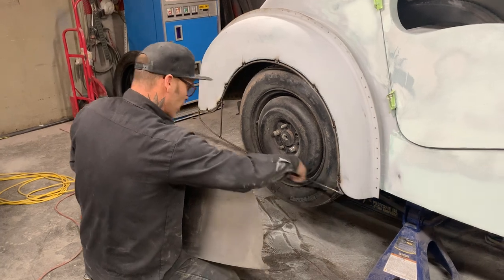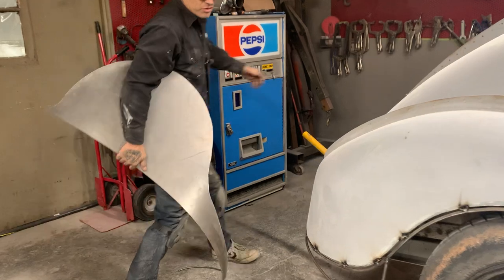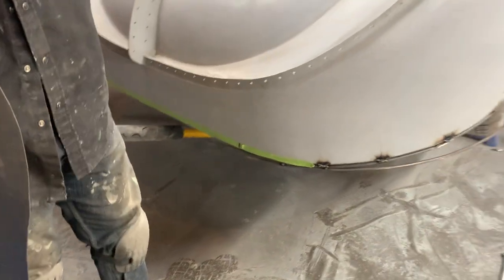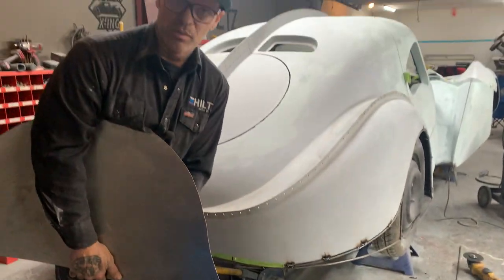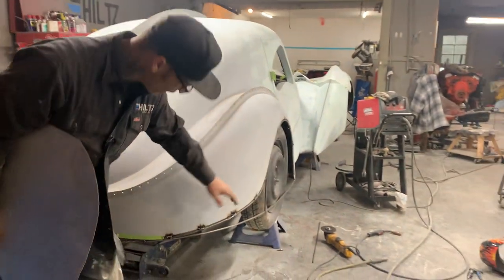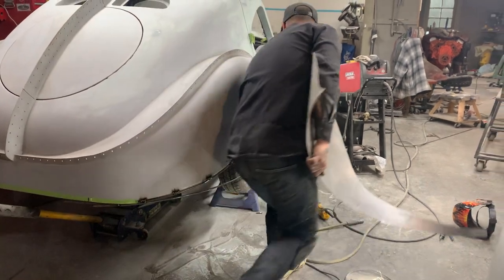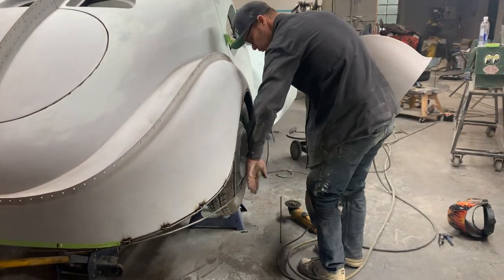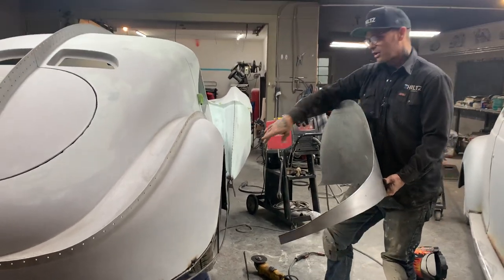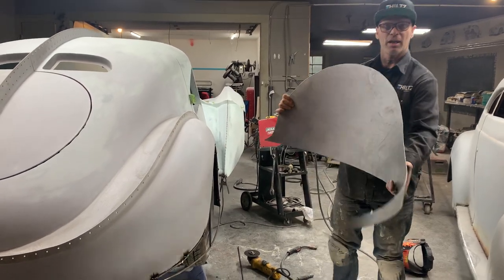This piece around here, as you can tell if you come back this side, is quite important when you're building a fender skirt, if you're doing it the way I'm doing it. I'm going to put the fender skirt on under pressure, and it's going to make itself be what it needs to be. This is round here, and this is all round here. This is not just going straight. This has got a nice round shape to it. So when I put this on, it's going to keep that round shape all the way through the running thing because I've got it bent. I've got it rolled.